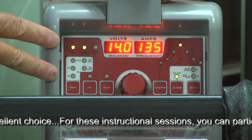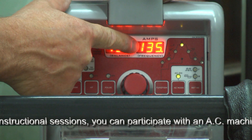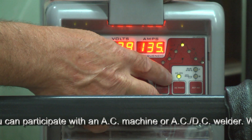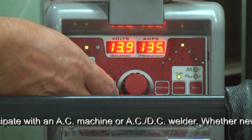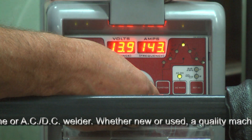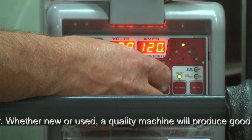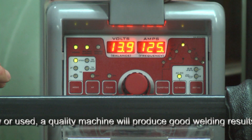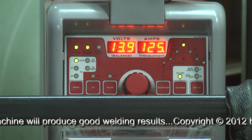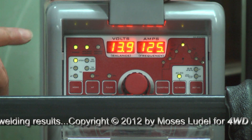Going back to our control panel, notice that we have the mode set for stick. Amperage is currently at 135, voltage is 14 volts. We now have it set in AC mode — AC is on. We can adjust right from this panel and dial the amperage, raising and lowering it for different electrode sizes and thicknesses of metal. There's 125 amps, 13.9 volts, AC mode stick. Simple as that, the 221 machine is now ready to weld in AC stick mode at 125 amps.